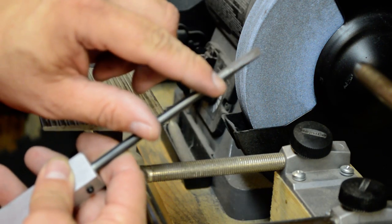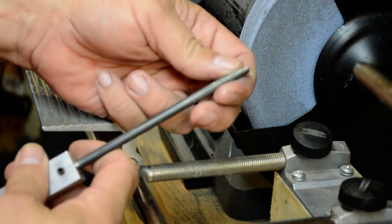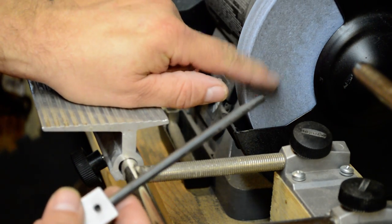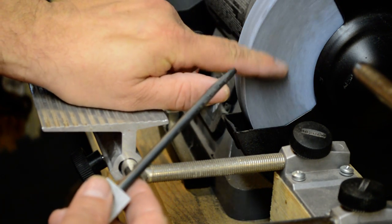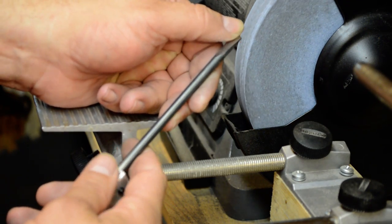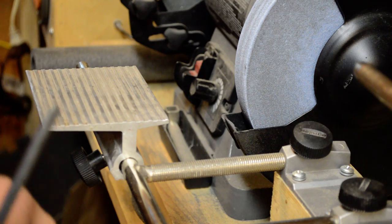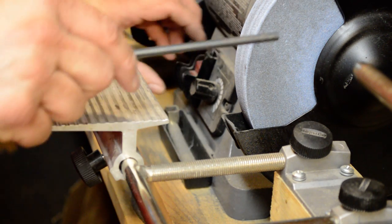The length of bevel you do is whatever makes you happy, but you need to make sure you go past the halfway point of the diameter — that way you'll get a sharper cutting edge. I've done most of this one this morning; it takes a while. I'm going to finish it up. This is a Norton 3X 100 grit wheel — I don't put much pressure on it; I don't want fourth-of-July sparks. I don't want to wear it down prematurely or get it hot. I've got quench water down here. I'll finish this grind and then show it mounted in the Tormek turning tool setter on the jet slow-speed grinder.